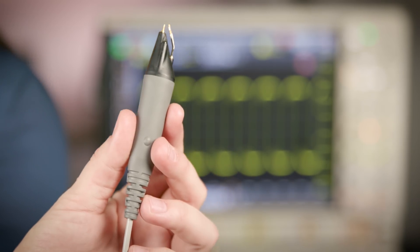Connection bandwidth is really important to think about. The shorter the connection is between the probe tip and your device under test, the higher the bandwidth of the system will be. The longer the leads, the higher the inductance felt on your circuit. This inductance forms an LC circuit with the probe tip capacitance and any other parasitic capacitances.